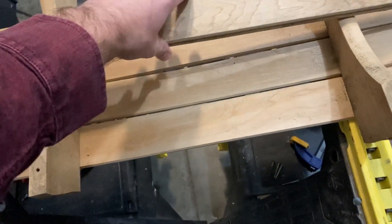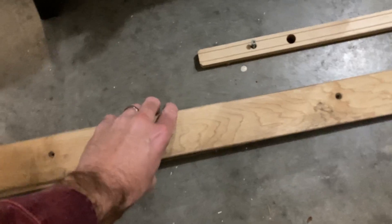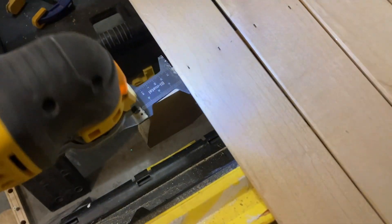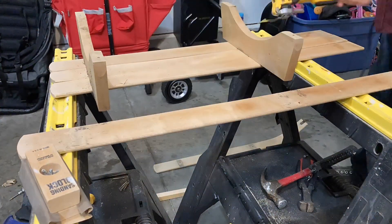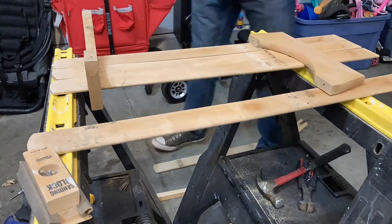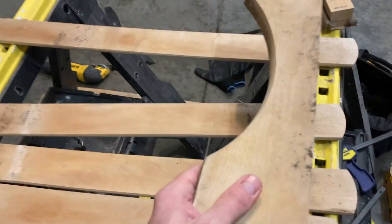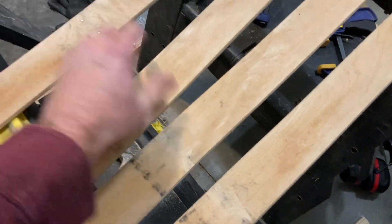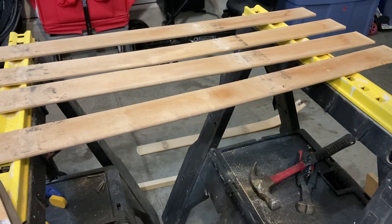We're going to take off the slats and the little curved sled legs and separate everything. We're going to keep special track of the screws because we're working in the garage and we don't want screws to become lost and end up in a flat tire or something. With the multi-tool I've got my metal cutting saw at the end — I'll put links in the description below for all the supplies and tools you need for this job. We're going to actually cut through those — they're like heavy duty staples or brad nails — and sever those off and file them down so they're nice and smooth.